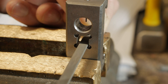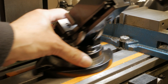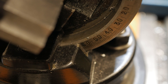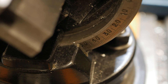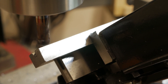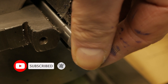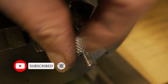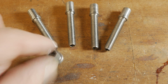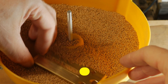To build the V-shaped support the greatest amount of time was spent positioning the piece in line and at the angle of 45 degrees, because the amount of material removed with the vertical machine was very little. I took advantage of the possibility of polishing my pieces with vibration and nutshells, and I must say that the result was very good.